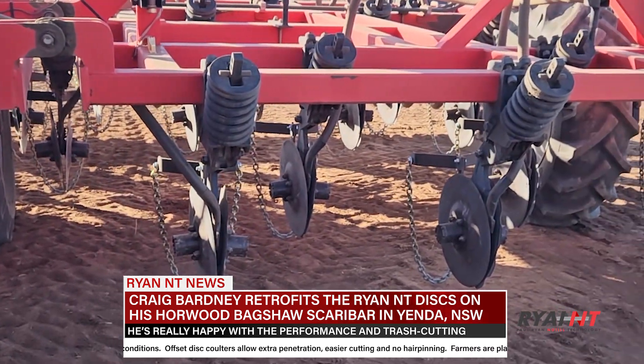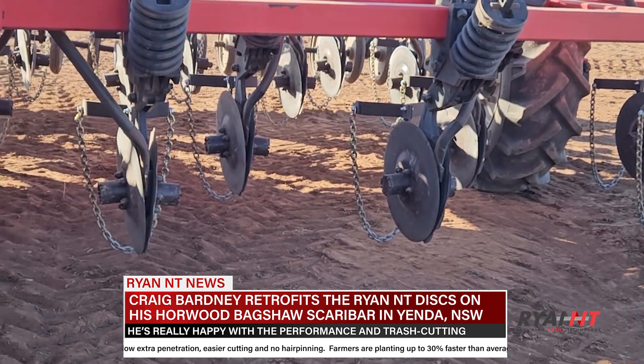In seven seasons have you had any bearing issues? You mentioned that you did your first one recently. Yeah, they've been really good. That's only one bearing — it happened yesterday actually, believe it or not. I had a spare gang assembly sitting on the shelf, just changed it, put the discs on and away I went. It took me an hour to get going again — just undoing the two bolts on the head assembly and the sowing tube and away we go. I think it took me by myself two days in the workshop to convert it all over, and it was all trouble-free, everything went together as it should. Two bolts and out comes the tyne and in goes the disc assembly. Pretty impressed with how it works.